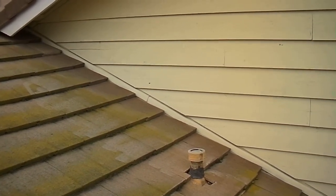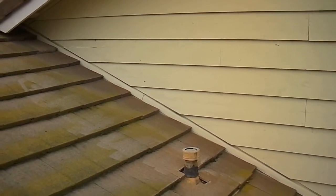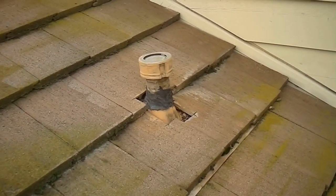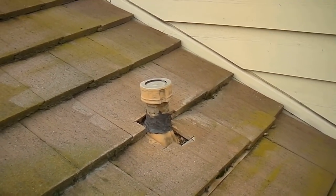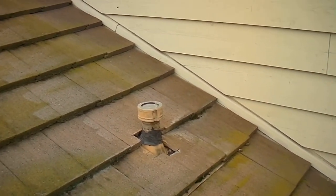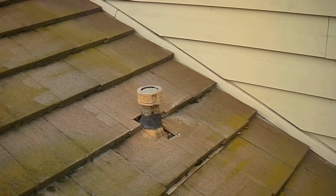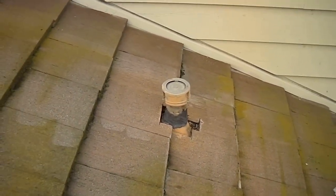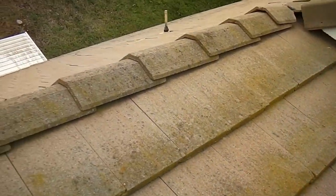This is the garage roof. Over here by the gable wall of the house, we see we have the flue for the water heater. If a flue is closer than eight feet to a house wall, such as this one is, the flue should extend two feet above the roof edge. So I'll recommend a qualified professional come in and put an extension on that flue.